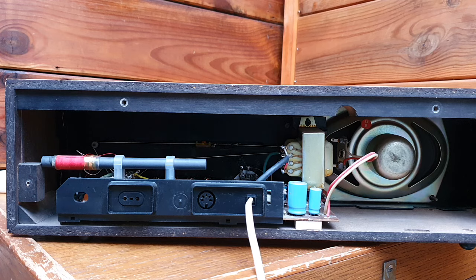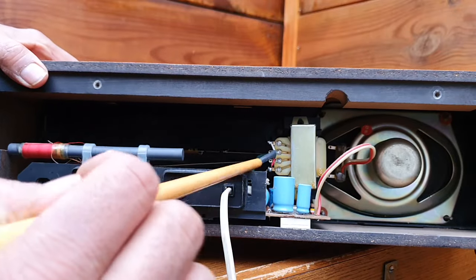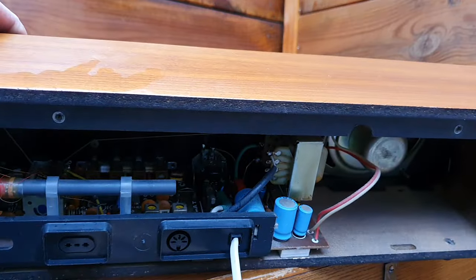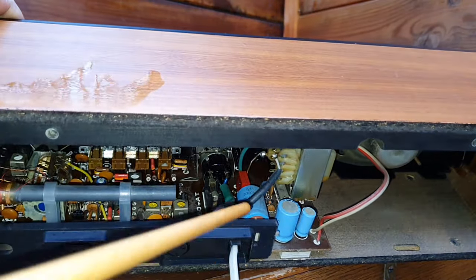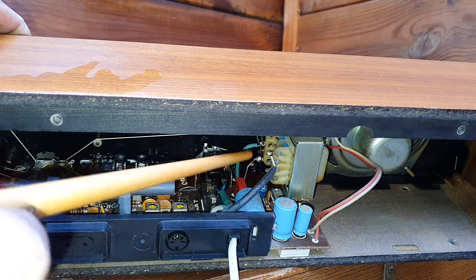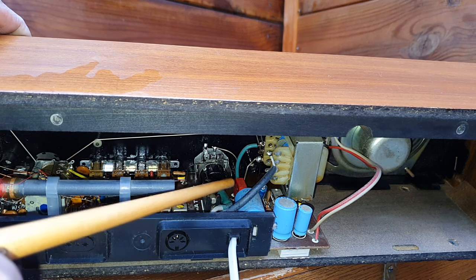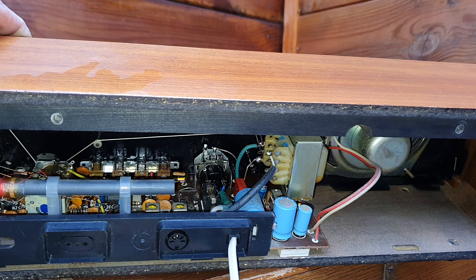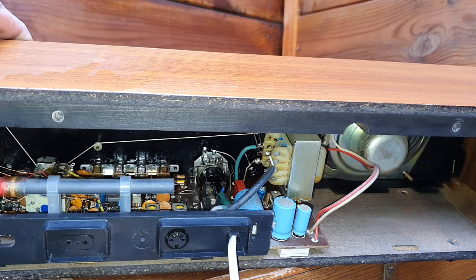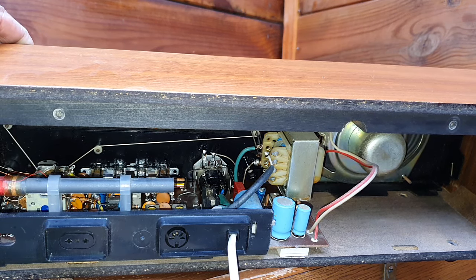For the sake of those who are interested to see, this is a speaker made by Philips, and this is the power step-down transformer. 220 volts go in, 6 volts come out. That red square thing is a bridge rectifier, which is 4 diodes in the circuit, and they convert alternating current into DC. These are filter capacitors, which reduce the hum and noise that AC carries, because alternating current changes polarity 50 to 60 times per second, creating oscillation. You want to remove that oscillation, because radio signals pick it up and you hear the noise.